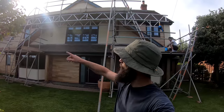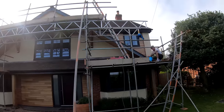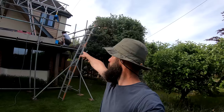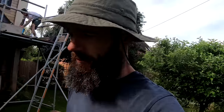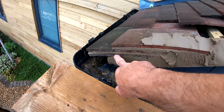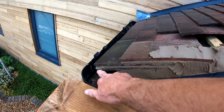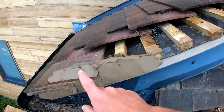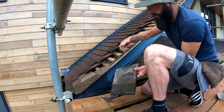Good morning. Nearly forgot to get the GoPro out — hence why I'm out of breath, I just legged it to the van. Good old Jay reminded me. It's the last day today, fingers crossed, and the plan is to get this verge done on both sides. We've got Jay on this side here working down the bottom — he's already cracking on. He's only been out of it for a few years but he's straight back into it. I've already made a start. So we've got the first course on here — it's the eave, then the next one's a tile and a half, bedded to the bottom of that one. Then we've got our next tile going on. I've already put my muck on there. See the nail hole on that there? Every tile going up now, you've got to nail it.